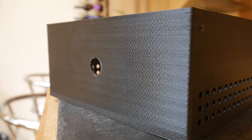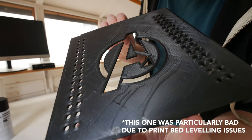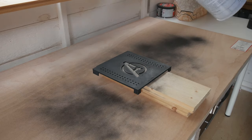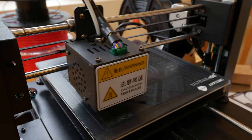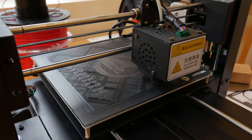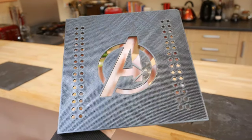The vertical parts of the print came out great — I really liked the textured look of the layers. The top of the case however was the bottom layer of the print, and whatever I tried in terms of print settings I couldn't achieve a finish I liked. I tried sanding and spray painting but it didn't turn out much better. Plus I really liked the idea of keeping it unpainted. In the end I decided to try printing it without any bottom layers. This gave me an outside layer using only infill and a much more interesting textured finish — looks almost like a dark digital camo effect.